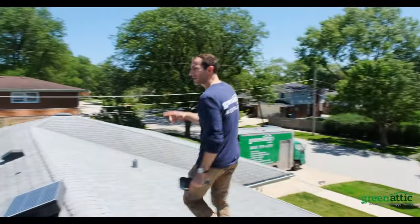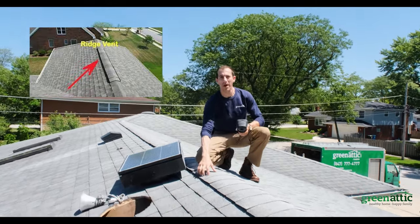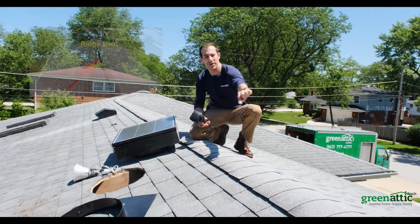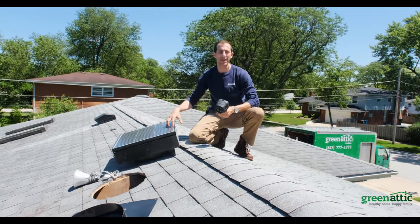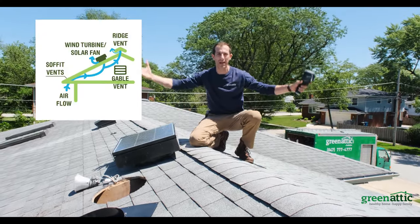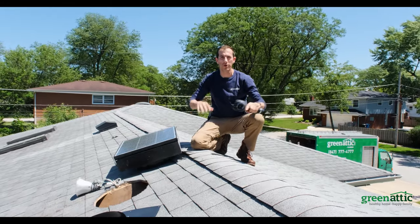In this setup you can see across the neighborhood — houses that have it and houses that don't — because there's a gap right here at the top, and that allows just continuous airflow right along this top perimeter. It will work in conjunction with the solar fan to let all that excess heat out, and it will be much cooler under the insulation all year long.